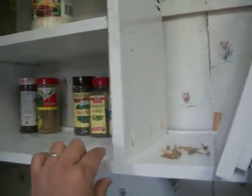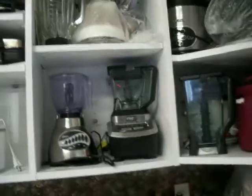And for the countertops, standard, the top of your countertop on your base cabinets is supposed to be 36 inches, and then it's another 18 inches between the countertop and the bottom of your cabinet. And that's what this is, 18 inches, 54 inches from the floor, which also isn't exactly level and even at all places. But visually, when I put the 1-inch rail on this, you won't be able to tell that they're a little wonky here and there.